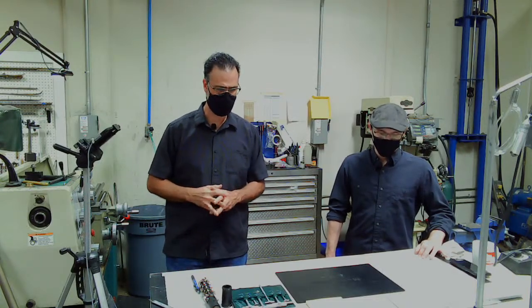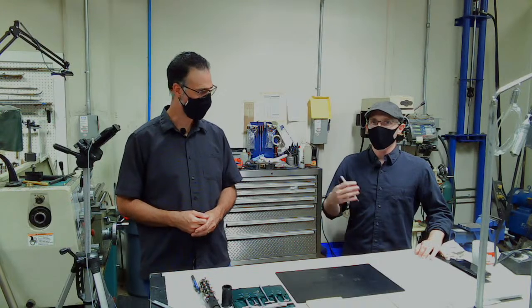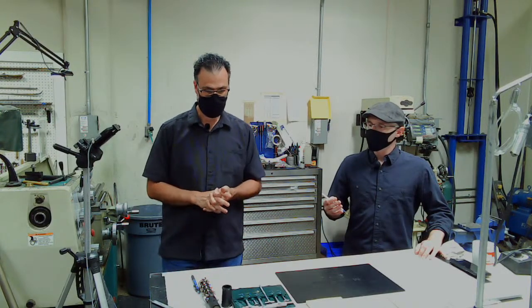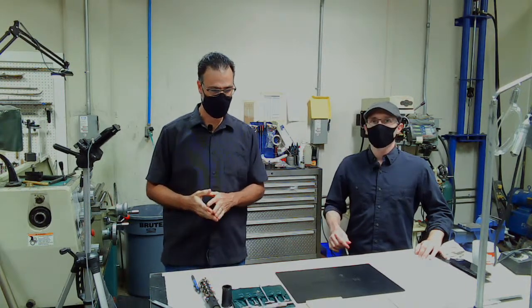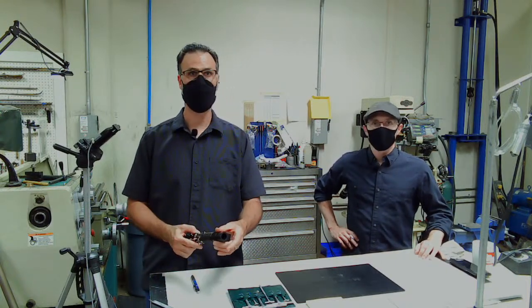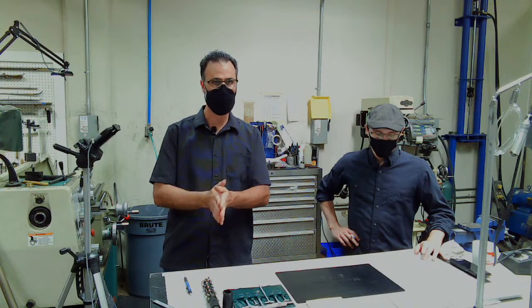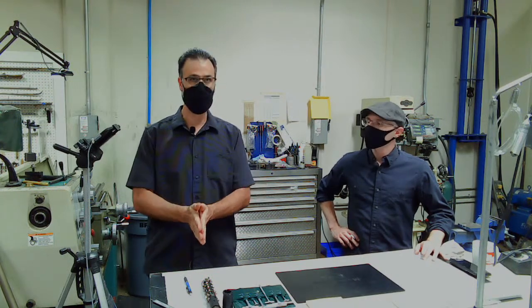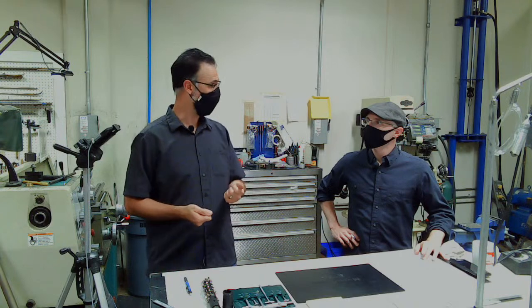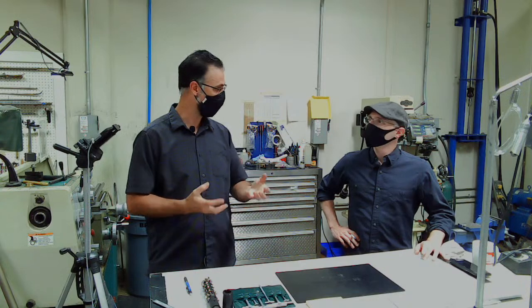Can you leave the tenon cork on if someone is going quickly in the shop? You can, but I advise against it because the tenon cork itself can give you a false reading of whether the barrel is actually catching the body. On newer horns the wood will expand and the tenon cork itself will be on the small side, so once you remove that wood it actually doesn't fit well at all — the only reason it had a semi-decent fit was because of the wood-to-barrel contact instead of the cork.